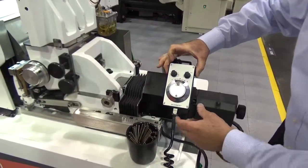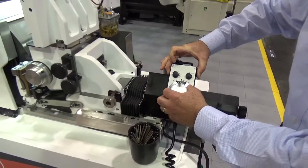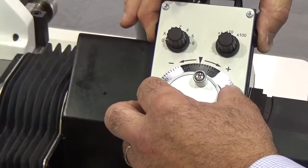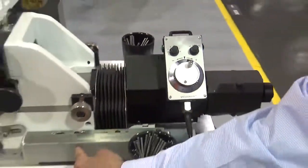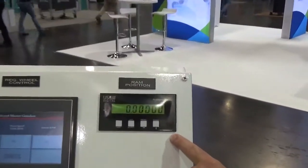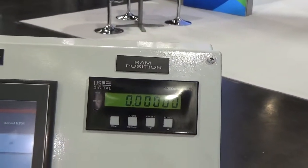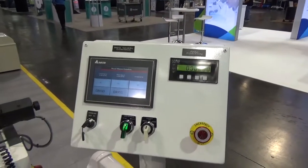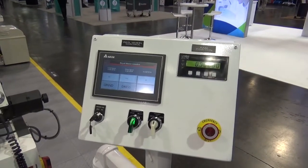In run mode, the pulse generator operates by turning this dial. A glass scale reads onto the digital display. It can read in millimeter or inch units at 10 millionth resolution.